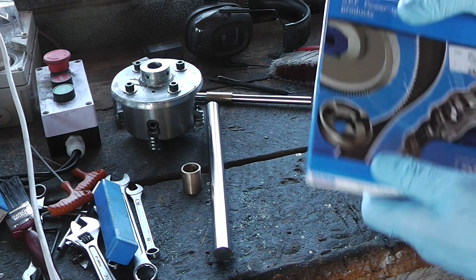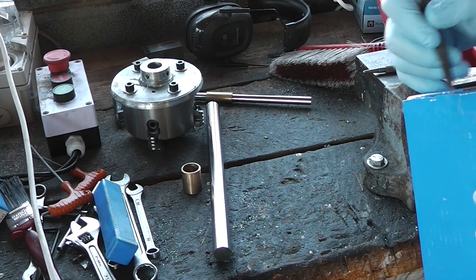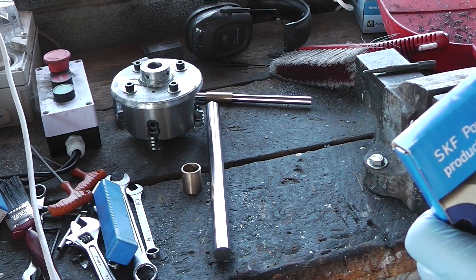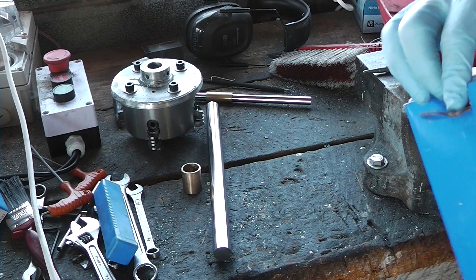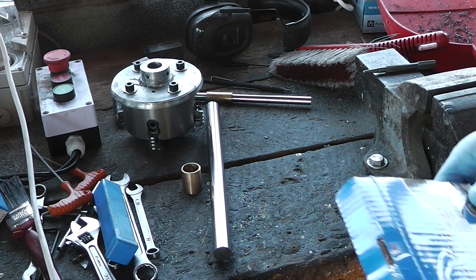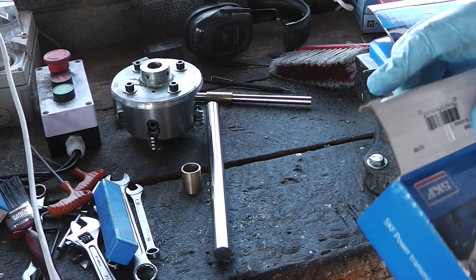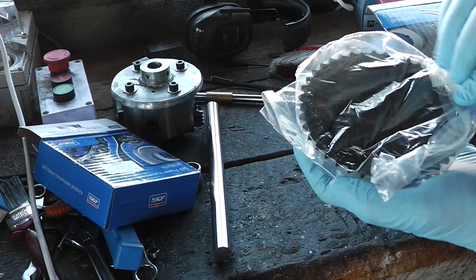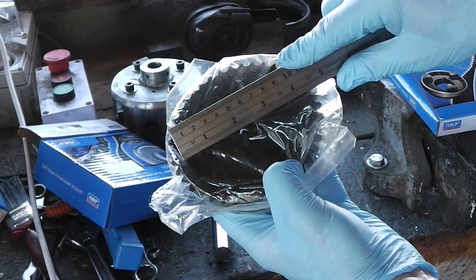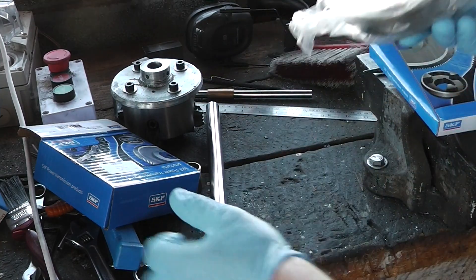What is the bull wheel, you may ask? All the way from RS Components — or I say all the way, it's from the New Zealand warehouse, which is a big part of why I got it from RS, because then I only have to order from New Zealand and it's not an international order. Now, Gingery specifies type 35 sprockets. Unfortunately for me, RS don't carry type 35 — they carry 06B and upwards. So this will be our bull wheel. There needs to be four bolt holes across for the scotch yoke componentry.